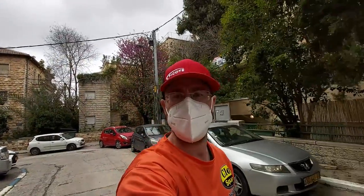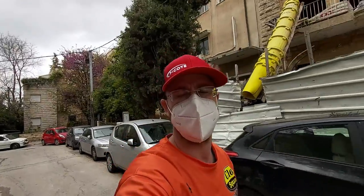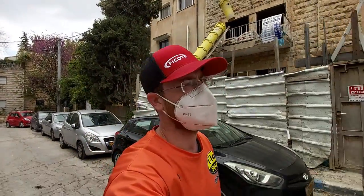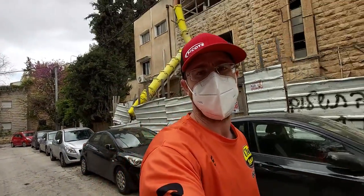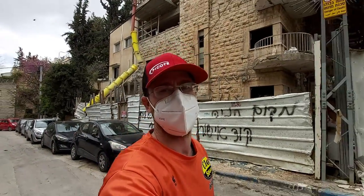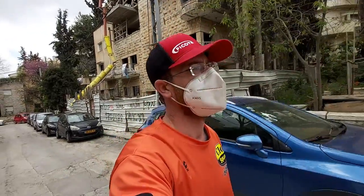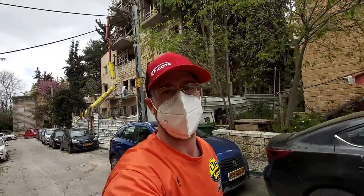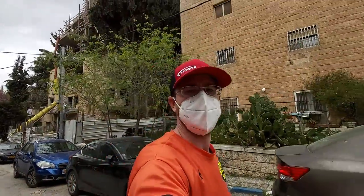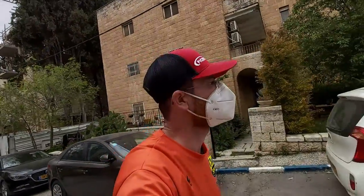Okay, we pretty much annihilated that clog. It seems like the main blockage was right at the egress of the manhole higher up, so we're probably not going to cement that or fix where the roots are penetrating. In the future, we'll probably just pick it up every once in a while and use a rod and knock away those roots. They're just renting there, so it's not something they want to invest in.